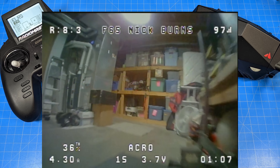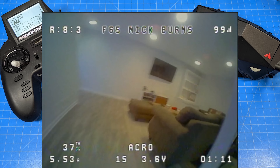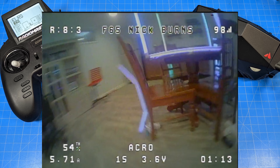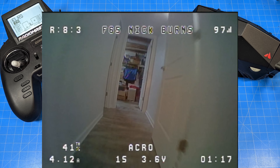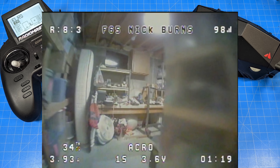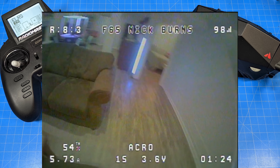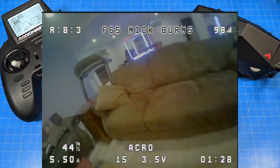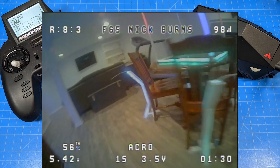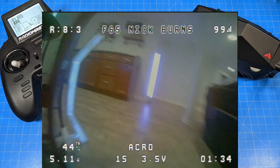I should cover video reception. I fly Race Band 8, mainly because Race Band 8 gets up above Wi-Fi, which can interfere with video transmission — that's always one of the basic tips I give. Also, construction matters. With traditional drywall and wood studs we have an open design, but if you have concrete or metal in your walls, that's generally commercial construction, and your reception may be far less than what I'm getting.